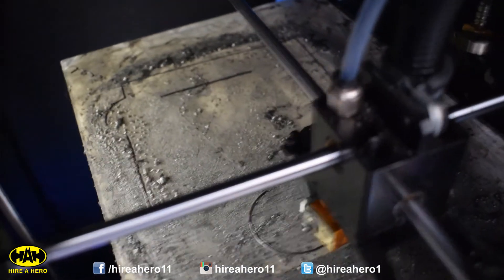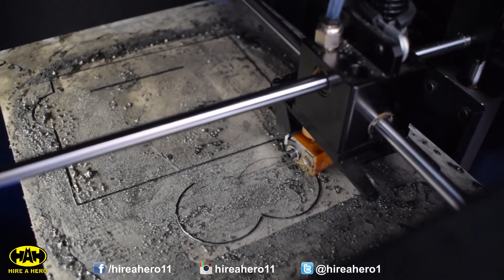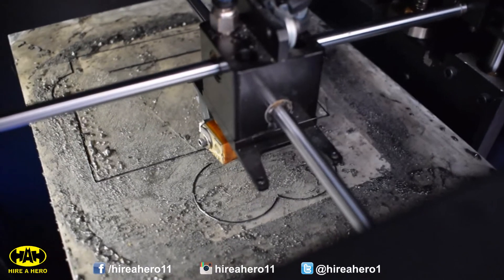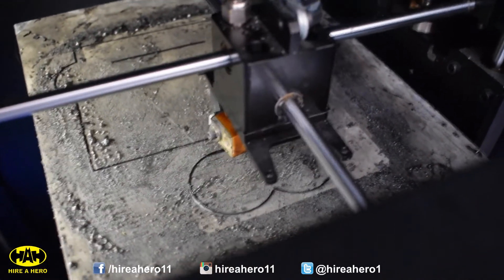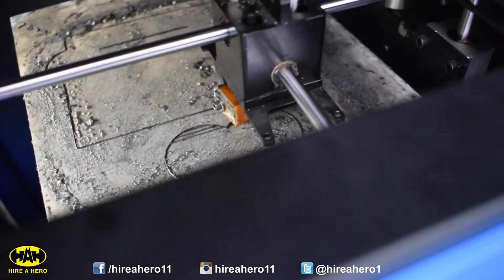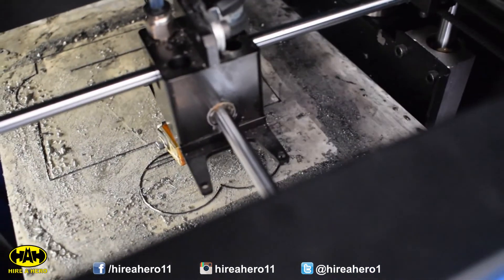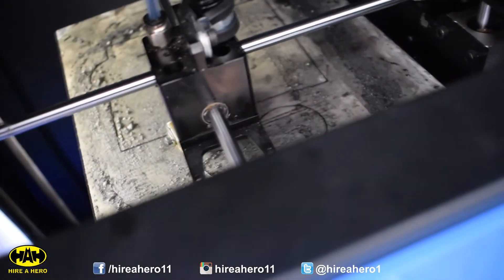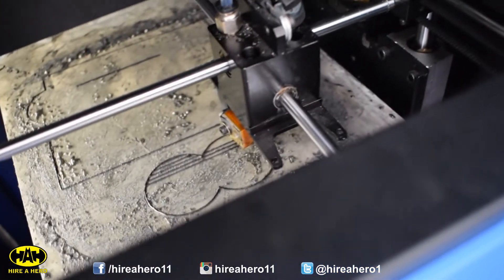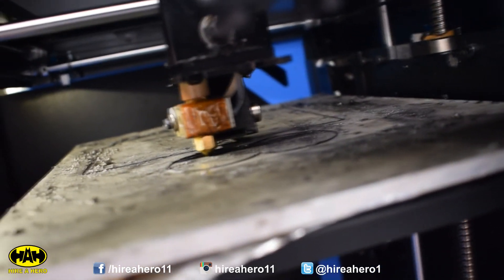It's taken close to an hour to get this going. The plastic wasn't coming out the end of the nozzle, and I think it's because the hole in the nozzle was too small — even though it's the size it recommends. I think over time the nozzle has slowly gotten ever so slightly bigger, and there might be a sweet spot between being brand new and too tight, and being old and worn like the one that failed. I think I've used a file and opened it up ever so slightly — and that's what's given me all my good prints with Groot, my sword, and all the other bits of the Proton Pack. So I'm just hoping it stays like that long enough to print a load of good stuff. If not, a new nozzle was only £12, so I wouldn't mind buying a new one every six months or so — especially as it's printing really well now.